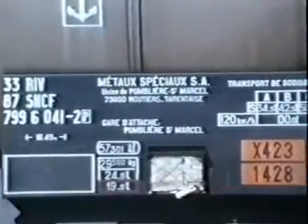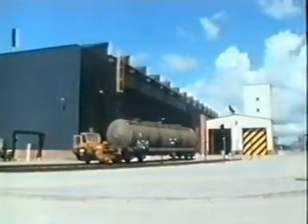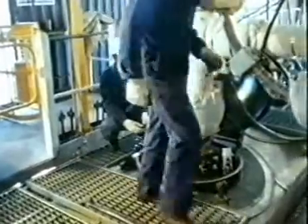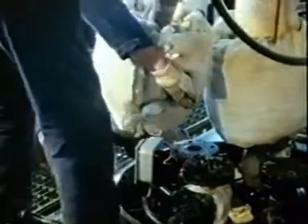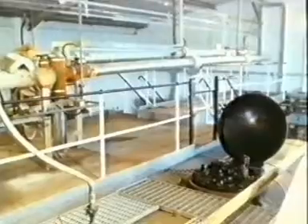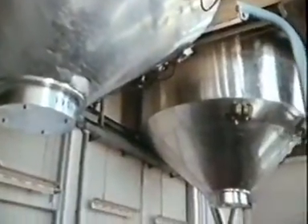When the canisters are filled, oil is poured in to keep air from the sodium and the lid sealed on. Sodium metal can be transported in other ways. This rail tanker is filled with sodium going to a plant where the important metal titanium is manufactured. The sodium in the tanker is heated so that the metal melts, then nitrogen gas is used to blow out the liquid sodium. The nitrogen forces the sodium along pipes to big storage vessels where it's kept liquid. Each of these containers holds hundreds of kilograms of molten sodium, which will be used to make titanium.